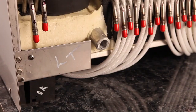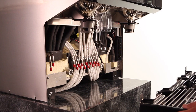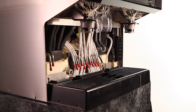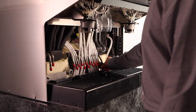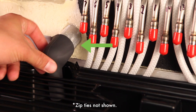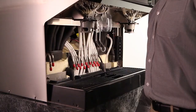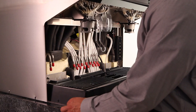Attach the drain line to the drain port of the rear of the drip tray and clamp tightly — failure to tighten the clamp can result in a leak. Place the cut portions of the drain line insulation over the hose clamp and ensure that the seams are sealed with insulation tape. To apply the drip tray, first loosen the Phillips screws on the lower left and right corners of the IDC Pro. Attach the drip tray to the IDC Pro by sliding the drip tray keyholes over the Phillips screws. Connect the drain boots to the cold plate drain ports and ensure they are facing down to drain into the drip tray. Insert the side screws into the mounted drip tray, then apply the drip tray cover so the side screws line up with the opening in the side of the drip tray cover and tighten the screws to secure.